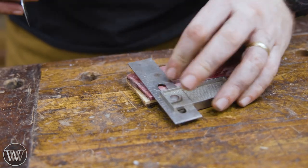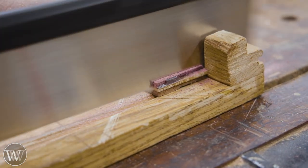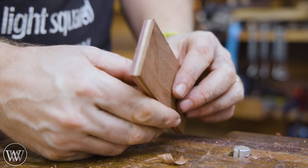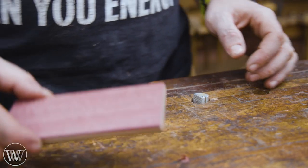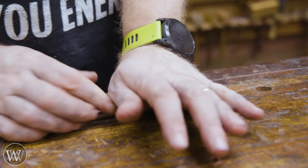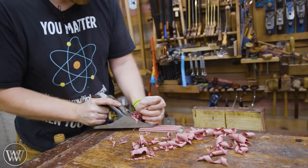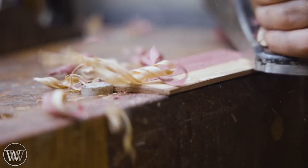With the exception of the purple heart, which has grain going in all different directions. For the two ends, we're just going to cut it down to length. The inside piece is a good bit thinner and the outside pieces are thicker, and I want these all to be about the same thickness. So I can just put it on a stop and plane it down until all three are roughly about the same. Then I want to plane it on an angle. I was doing a little bit of experimenting because I've never planed something this thin on an angle, but I figured I'd try it. Planing it on an angle would allow me to see all three woods as I plane through it. I originally put it on here with the stop, but found that the tape was more than enough by itself, so I slid the stop down and then moved it again a little bit closer to the edge so that my plane could kind of hang off.